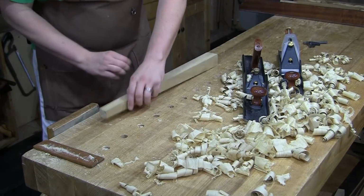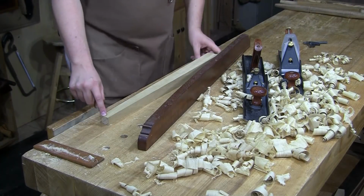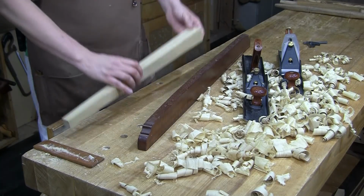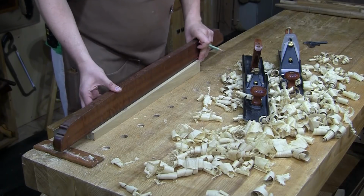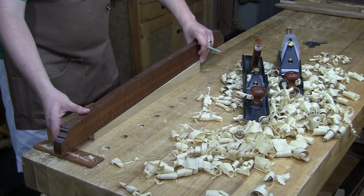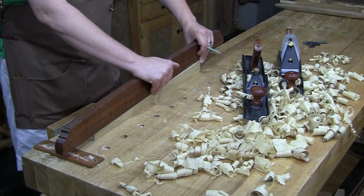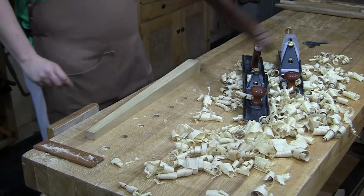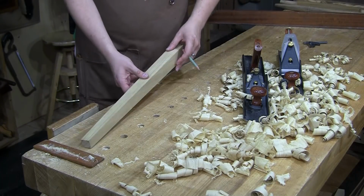And you guessed it, now I need to come back with a straight edge and connect the tick marks down here, but now I've got tick marks on the top because I've already laid out the octagon on the top. And so I connect these lines to essentially lay out the extents of the octagonal face. And you guessed it, repeat that on all the faces.